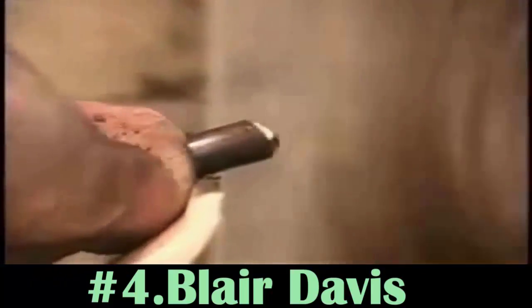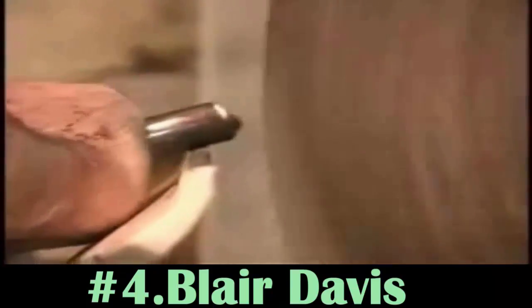So we'll start, and this is the careful part, because you're turning mostly air. You can hear probably that it's only cutting every time it goes around. And eventually we'll get it where you can hear it hitting twice, because it'll start to hit the two corners.